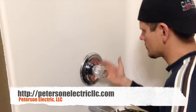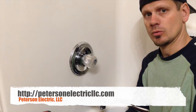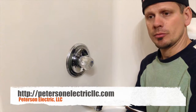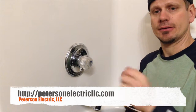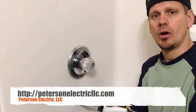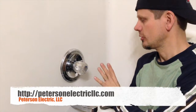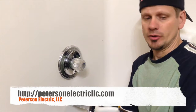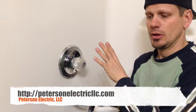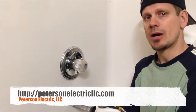So basically just returning this valve off, and I'll go down the stairs now, turn on my cold water. It'll pressurize the house. Probably wouldn't be bad to go ahead and hit that sink and turn it to cold, let that water come so the air gets out, and then turn on the hot water and then let the sinks come. That way the pressure kind of evens in the house before you go putting a lot of pressure on this area. You could flush the toilet, I guess, if you want, but really go into your sinks next to the same bathroom, or in that same bathroom next to the sink where your shower's at.